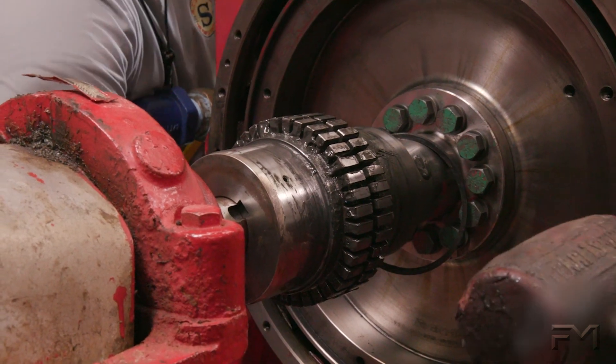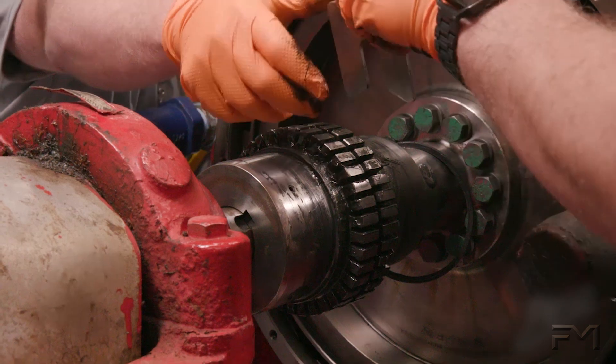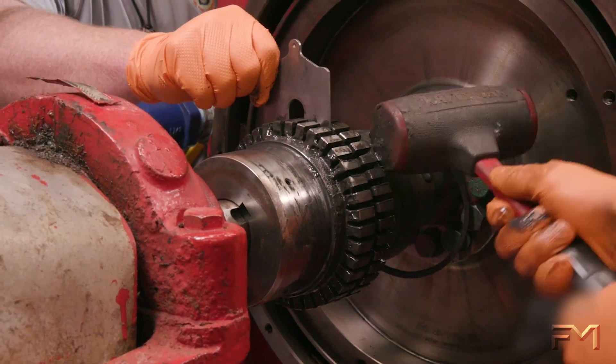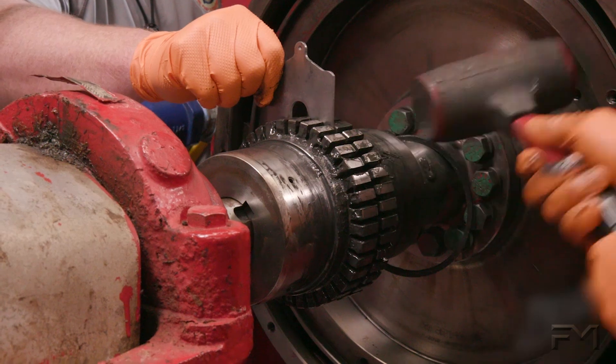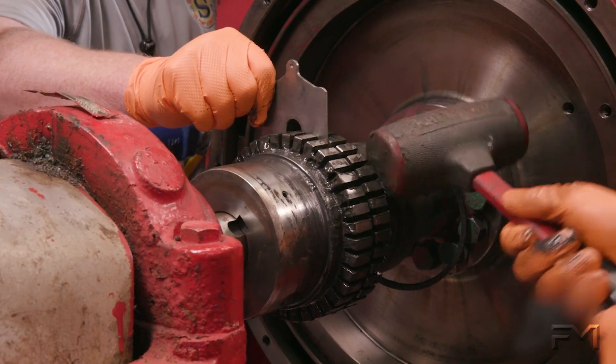In this case, the gap between the two halves is too large. Based on the manufacturer's specification for this coupling, the gap will need to be reduced to within the manufacturer's tolerance. The coupling halves should be evenly spaced on each side of the shaft.